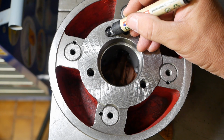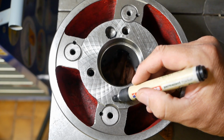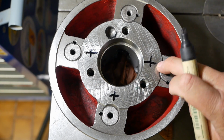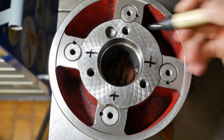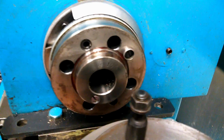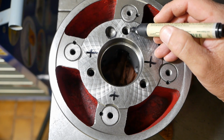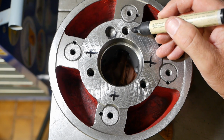I need to move the drive pin in about a millimeter, just ovalize that hole, and add the other 3 tapped holes. This hole will then be slightly out of alignment, but he thinks there's enough clearance for this to go through the hole in the spindle and through the bayonet plate and just work normally. And if it doesn't quite fit, he can turn down the outer diameter of the drive stud a little.